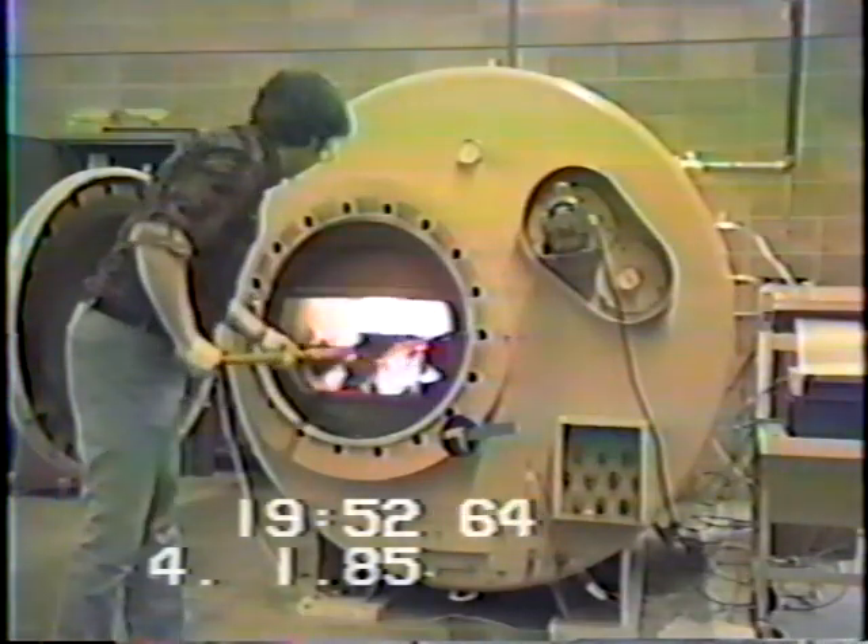The third column to the left is indicating the amount of combustible emissions from the system. We're now at 400 parts per million, which is an extremely clean burn, and our combustion temperatures are about 1,200 degrees.